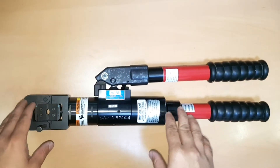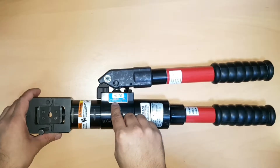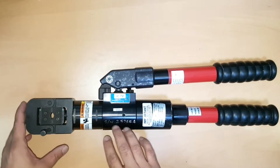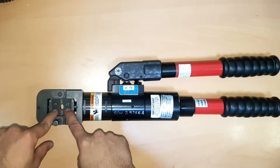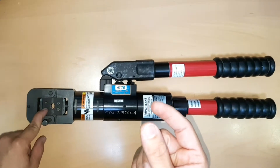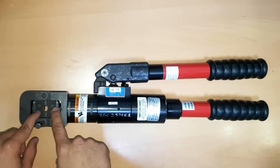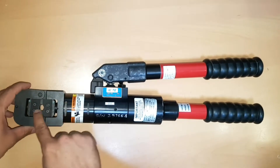I'll give you a little description about this crimping tool. The part number is 59974-1. This is the common tool; this is the die. The die can be adjusted as per your lug part number and the size. Right now we are using it for the 06 gauge, so we have already fixed the die for that.